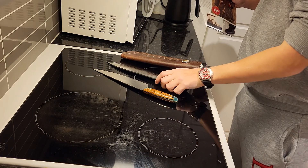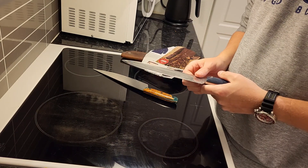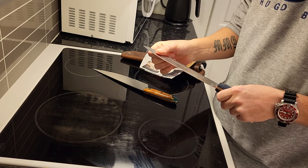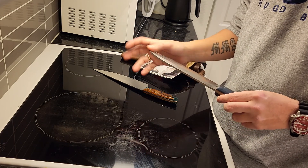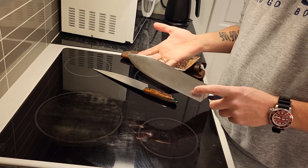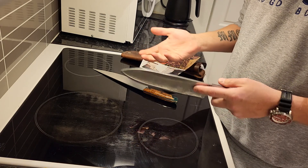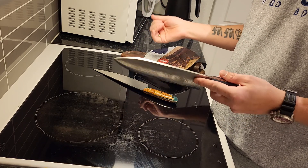I have two examples. I have an outdoor blade here, my own design. Aaron Johnson made it. He hasn't got an HRC tester, but he uses HRC testing files — not completely accurate, but gives you a ballpark. They are pretty sure this is 62.8, 63, around 63.2. Very hard.